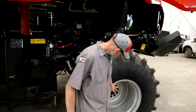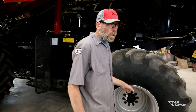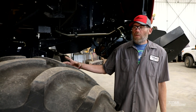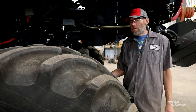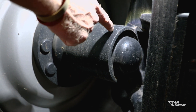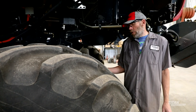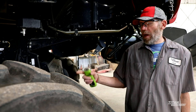Next we'll go to the back axle. Same thing — just look and make sure all your lug nuts are on your back tires. Then take a look at your bearings. For your wheel bearings on the inside, there are metal caps in there. Make sure those caps aren't dented or missing. If they're dented or missing you need to replace them so you don't fill your wheel bearings full of chaff. If chaff gets in there you'll have to take your wheel bearings apart, clean them out, repack them, and put them back together. Also with the caps off, I have seen the cotter pins that hold your wheel bearings on actually break off, and then your wheel bearings will run loose and it can back the nut off enough to where you could lose a back tire.